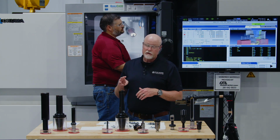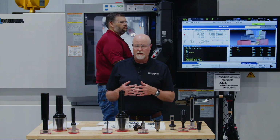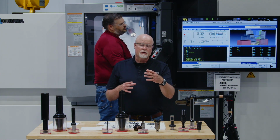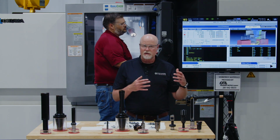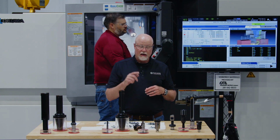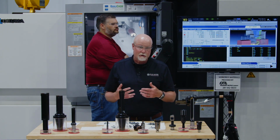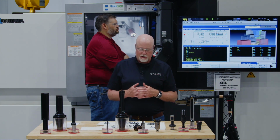The third type we have is AS5202, the mil spec style. It's commonly used in aerospace applications, and it has a slight metal-on-metal contact in addition to an O-ring. The difference is that ISO 6149 and J1926 are designed to hold back a pressure of roughly 3,000 psi. The AS5202 is designed to hold back a much higher pressure, about twice that, like 6,000 psi. It's used in aerospace and some military applications as well.